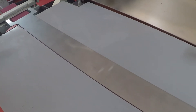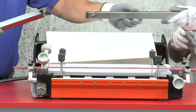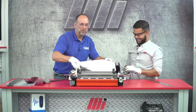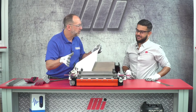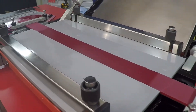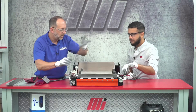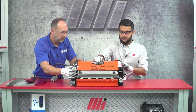So let's go ahead and remove the pressure plate, and let's clamp the template into the bottom beam of the press — you can go on the outside, I'll go on the inside. Next step is I'm going to put my silicone cloth on. Notice I'm not using any silicone sprays, no aerosols or anything here. The bottom template is made of silicone, the top cover is silicone, so they're both acting as release agents. Now that template — we know it's in perfect alignment — we can rest it in place right in between the cutouts on those end clamps. Let's put this beam on and then clamp each end.